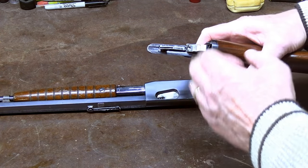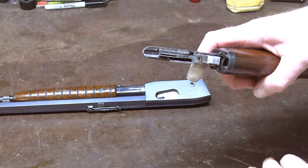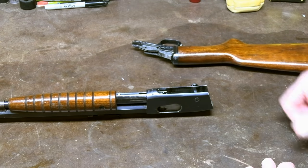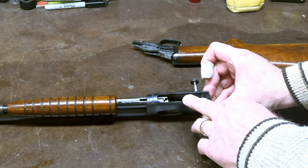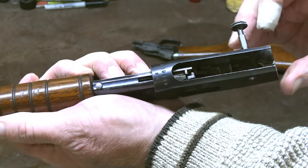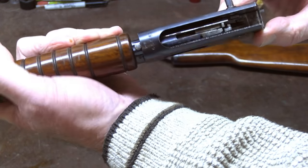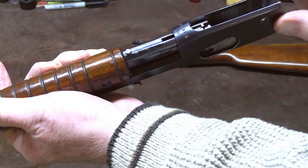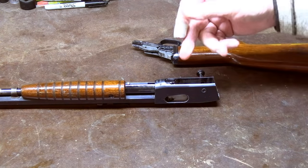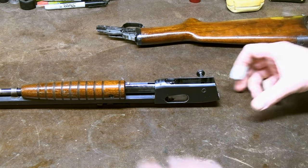You can see it's a very massive, very wide, broad hammer. This is the lifter that carries the cartridge from the magazine. In this end here, this is the receiver and barrel assembly — you can see it's quite complex inside. This entire mechanism is probably one of the most complex in all of firearms, especially for .22s. I'll show you how to simply take that apart so you can remove the bolt for breech-end cleaning. As with many breakdown takedown .22s, you can very easily clean it from the breech as you should.